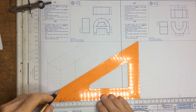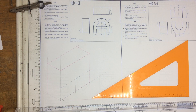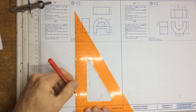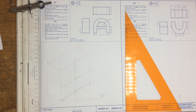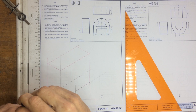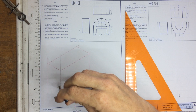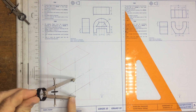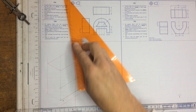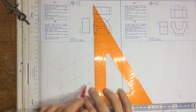Now I need to think about how I'm going to draw this semicircle. I'm going to extend the center line down. The radius is 40, so I set my pair of compasses to 40 and go to the center. I mark 40 on that center, 40 on that center, 40 on that center, and come down to the extended line and mark 40 there. Then I construct the isometric square so I can find the points needed to draw the arcs.